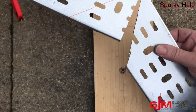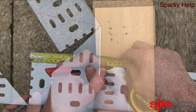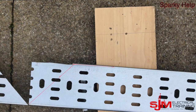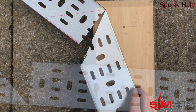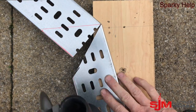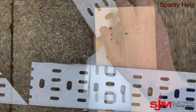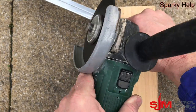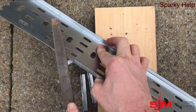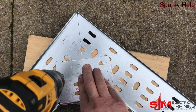And on the other side, because I've not cut that one out yet, I'm going to measure 88. And I'm just marking out the lips that I'm going to cut out. So the returns on the tray are basically all cut out there. If I get my angle grinder, we can cut those out. Don't forget — file them all up. Because the whole point of the tray is to secure the cable. You don't want sharp edges for yourself or the cables. Cut those out, file them up. And then when you put it back into a 90, that will fit spot on to those measurements.